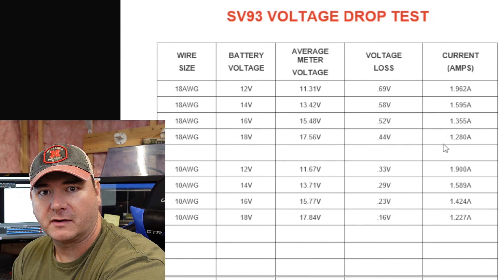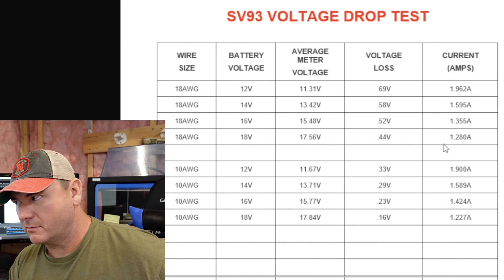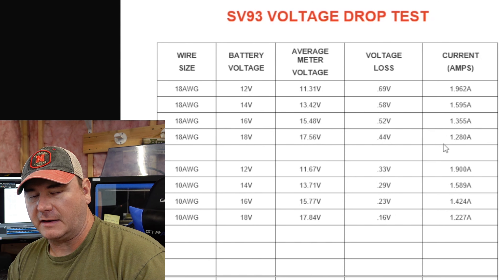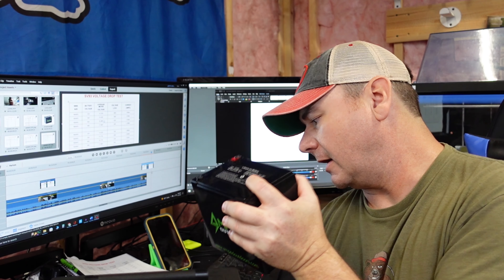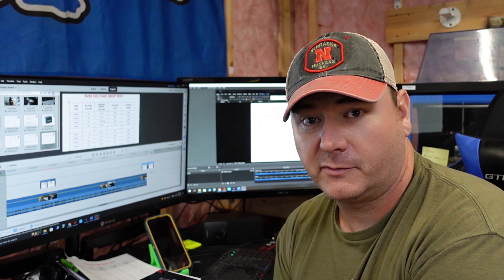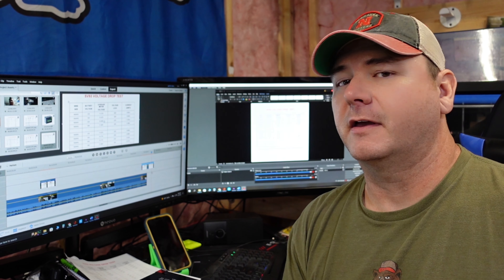You're probably going to be more in the 16 volt range so you'll lose about half a volt. If you're running from a livewell rocker, cut all these numbers in half — you're running maybe 8 or 10 feet of wire so your losses would be pretty minimal. If you're running 18 AWG with one of these boxes, you'll lose probably a quarter of a volt at 18 volts.